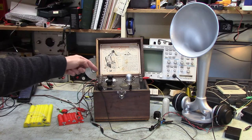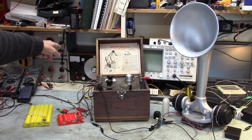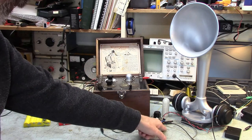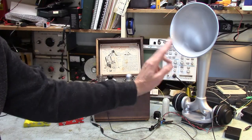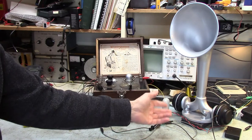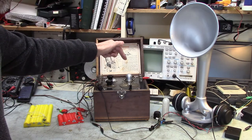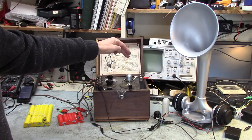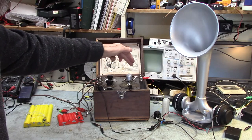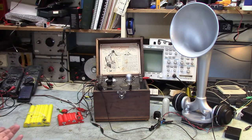I did some further tests with the tickler using the signal generator — I'm piping that in through my MP3-playing signal generator, and of course cheating quite a lot with a little modern transistor amplifier capacitively coupled, then going to my homebrew replica headphone adapter speaker horn. Fun thing to do to build up these little projects just for the fun of it. I basically tried several different configurations for the WD-11 resistor methods to make the 5676 look like a WD-11 for the radio. The shunt is probably the most generally practical — the radio will behave pretty much as if it had a WD-11, with higher pack current, but how often are you going to play this thing?